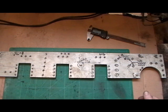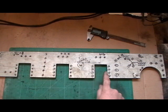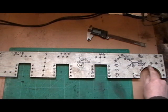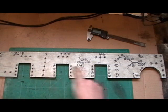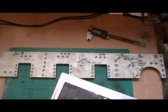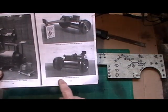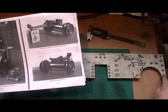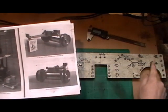I've had a bit of a clean up now, come off my milling machine, cleaned down, and cleaned my workbench. I've deburred everything. I've now got my slots cut for my horn guides, and I've got the cutouts for my pony wheels at the rear. I'm making an 0-6-2 version of a Sweet Pea which is called a Meter Maid. The pony wheels are for the pony truck, which sits at the back — it's just a set of two wheels on a pivot point.